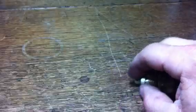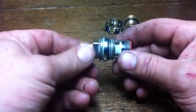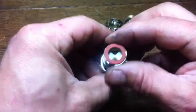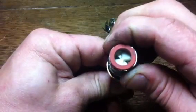Right, okay, now there's a few other different types of tap. This is obviously the screw down head type. A few things to know. This is the quarter turn. There's nothing you can do with these. You can't really fix them. What you've got to do is get a new set. It's because it's two ceramic discs, as you can see in there, that turn against each other and close off. Now there's not much you can do to repair that once they've gone.